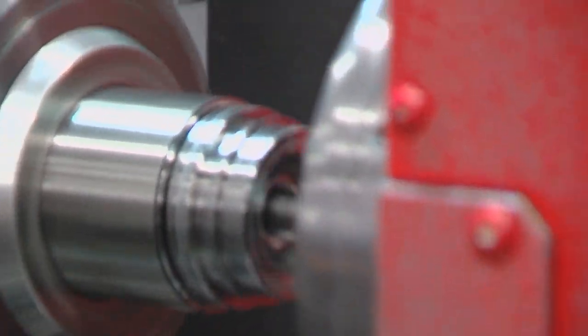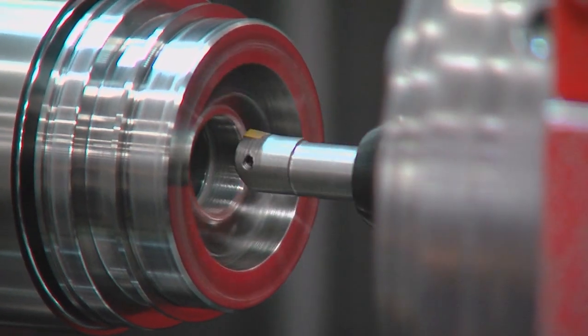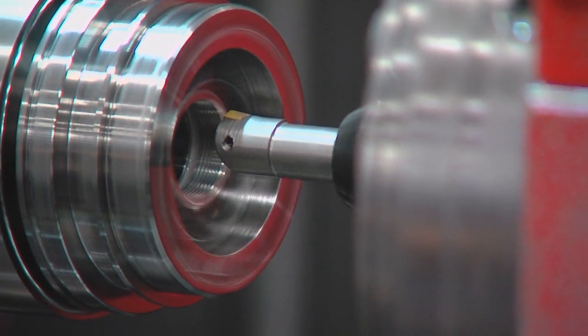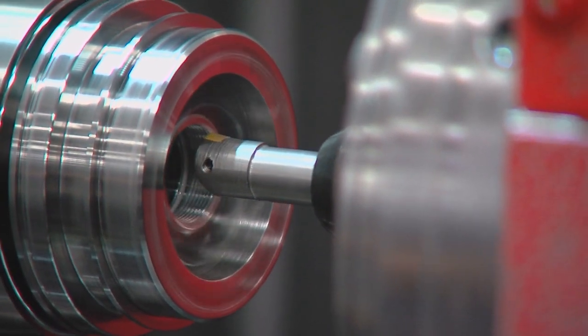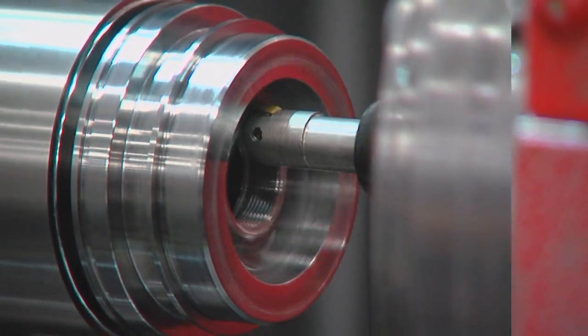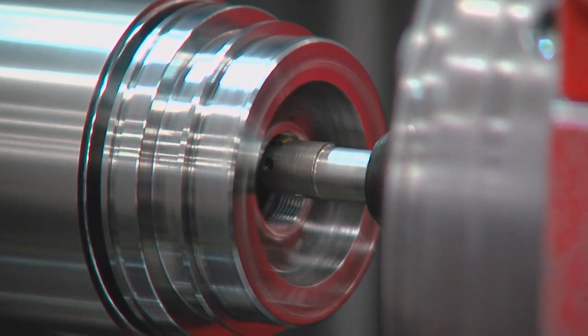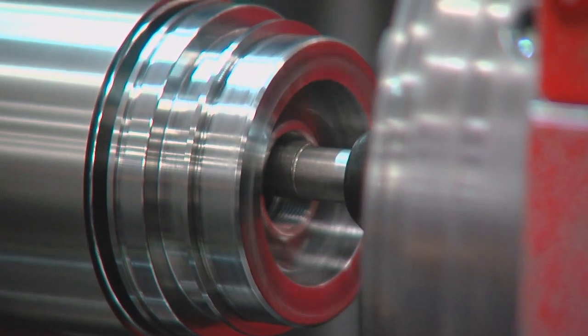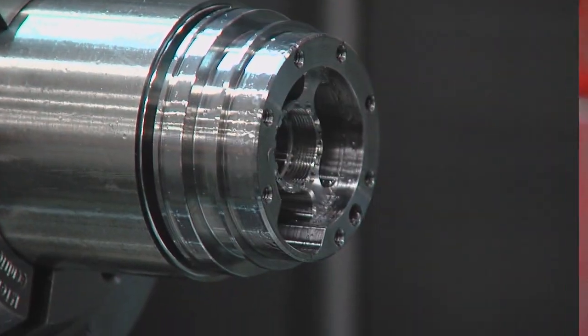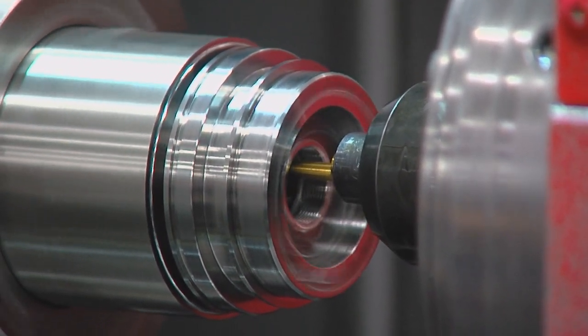It's going in to bore on the ID now. This is a rough bore tool that roughs out all of the interior profile — the tight 0.625 bore, the thread major diameter, the larger diameters — it roughs all that out, removing the majority of material that's left. Then it does several other operations: grooving and threading. Now this is the finish bar — it puts a nice finish on there and brings everything to size, repeating the same profile but at about two thousandths deeper. That machines the ID thread relief and groove so we can put a chamfer on the back of the thread.